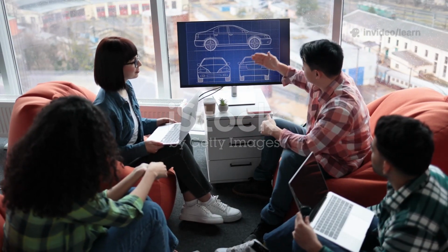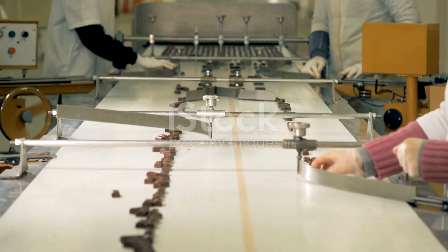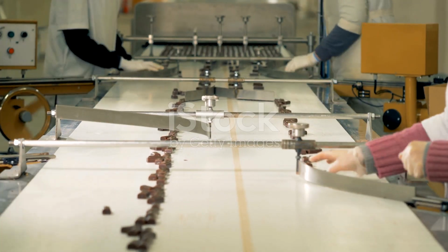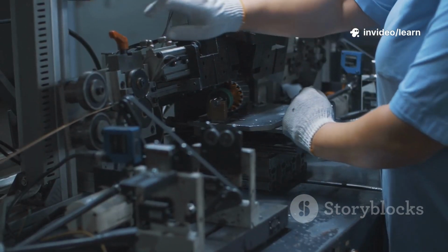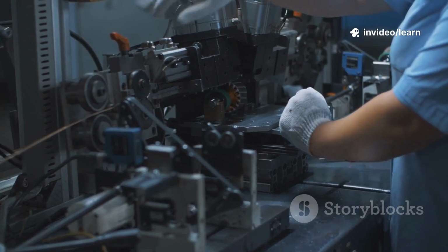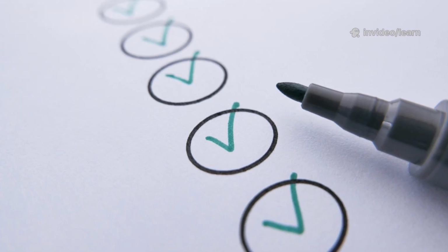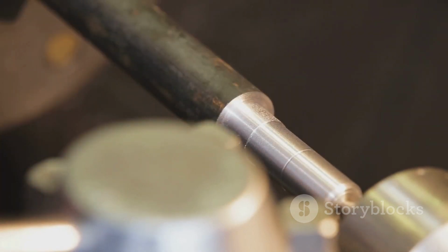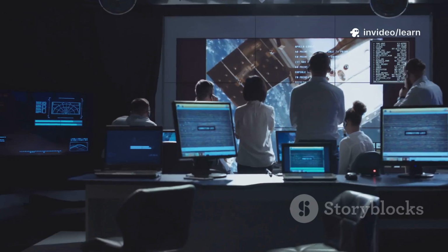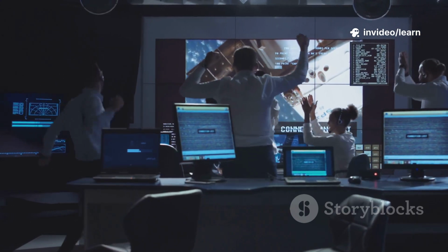What's the real purpose of a pre-launch control plan? Simple. Control the process during the first limited production runs. This is the validation phase, proving your process works before full-scale production. The plan acts as guardrails, focusing everyone on the most critical features that must be perfect. During this phase, you check every part for key features, not just a sample. It's a short, intense period to gather data and learn fast.